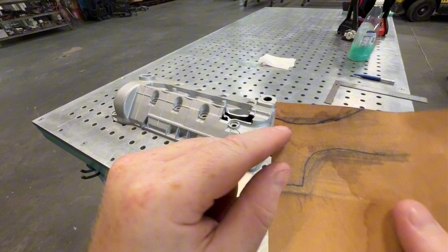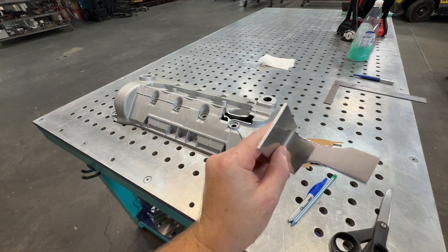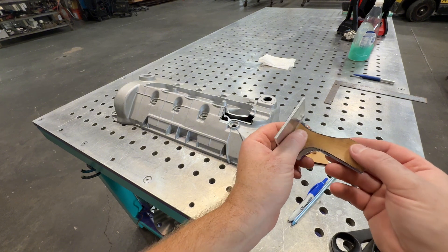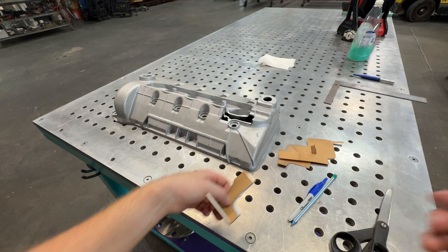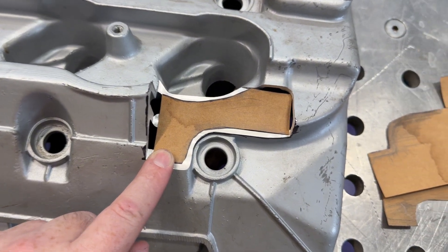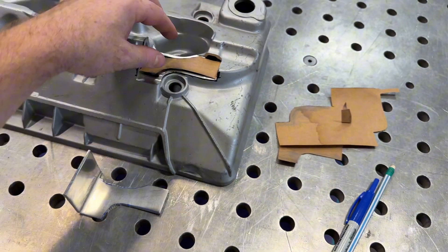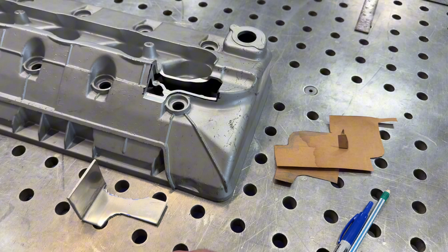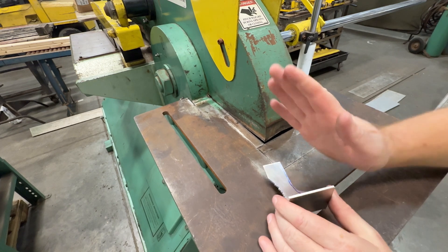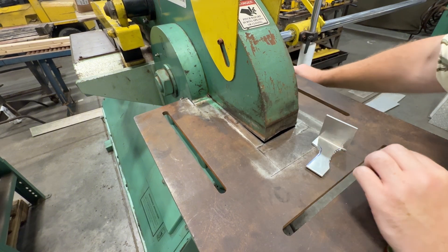It was a little hard to see the pencil marks so I took a marker and went back over it and cut that out. I had a bigger piece and just rolled it over so I could put a new trace line on it. Essentially the piece comes up right over there and I'll fill in those sides. I could put the weld right on there — it's okay to have a little gap like that. Now I'll trace it, cut it out. If I had a vertical bandsaw that'd be perfect, but my notcher and grinder is the next best thing.